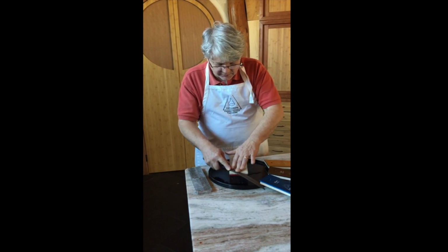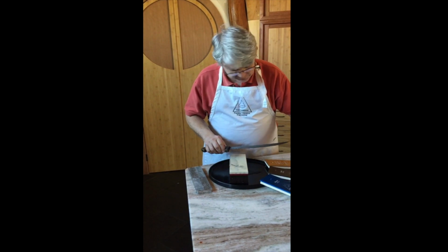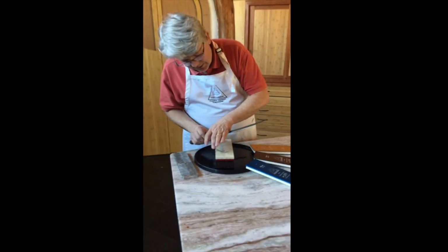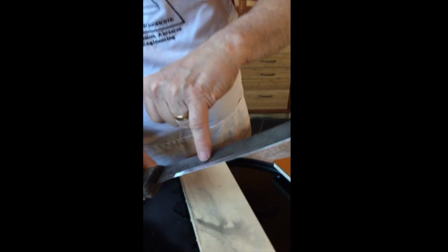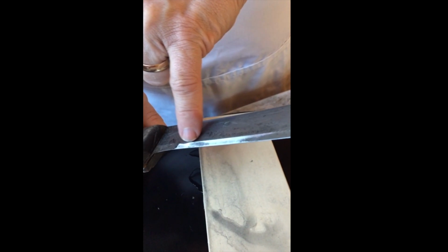And it's got a 8, 9, so that's about 10 strokes there. And you can see even those 10 strokes are just cutting right through, and there's some grind marks. It looks like the last time it was sharpened was probably with a belt sander. So you can see those belt sander marks, and then the smooth flat surface from the stone. So the stone's cutting pretty quickly.